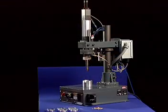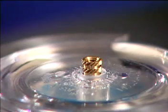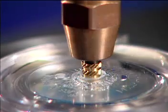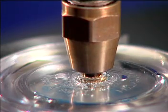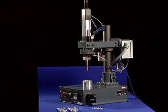To operate the model HP machine, the operator loads the plastic part into a part-holding device, places an insert into the hole, and touches the dual activation sensors. The heat tip advances, engaging the insert until it reaches a preset stop, establishing the installed depth of the insert, dwells a moment, then returns. The secret to the Spiral model HP's advantage is three-fold.